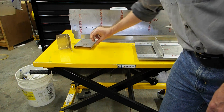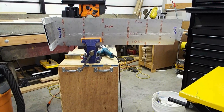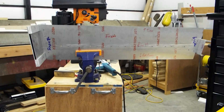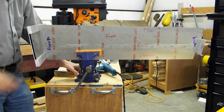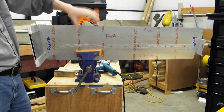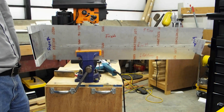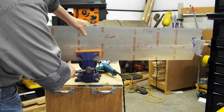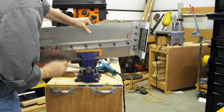That pretty much covers all the basic pieces. I'll swing the camera over and show the other one that's been fully completed to give you an idea of what it looks like. This is a view of the assembled one — it's the right-hand side, corresponding to the right-hand wing. If you've got a set of soft jaws for your vise, everything mounts up very nicely. Right now everything's cleco'd together and it's pretty much to the point of being ready to rivet. I'll turn it around so you can see what the backside looks like and how everything is assembled.